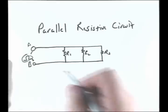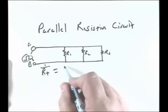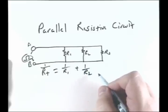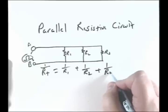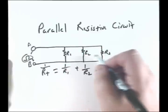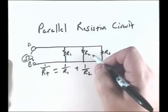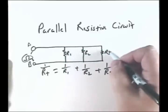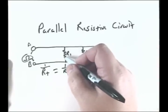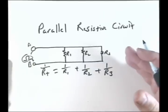The formula for solving total resistance in parallel would be: 1 over RT equals 1 over R1 plus 1 over R2 plus 1 over R3. If these were all 100 ohms, you take the resistance value and divide by the number of resistors — 100 divided by 3 — which gives us a value of 33 ohms, because it's easy to calculate when they're all equal.